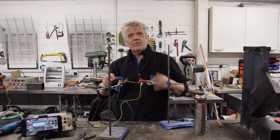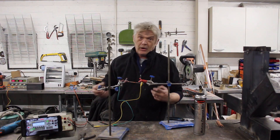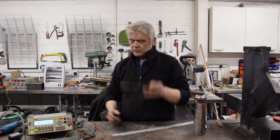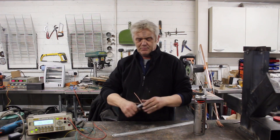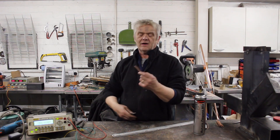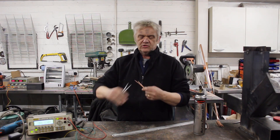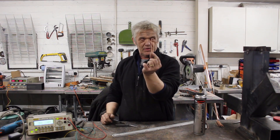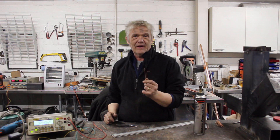Of course, that's not enough on its own. We want a few of those in order to be able to create enough energy to power something. So I'm going to make 16 of these. I've got lengths of wire 16 centimeters long — measure down to seven and a half centimeters and put a bend in it to make a hairpin, then roughly two centimeters down from the top put in a dog-leg bend.